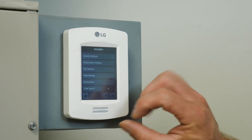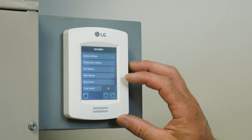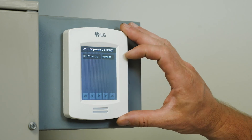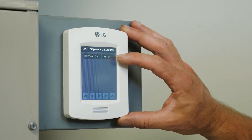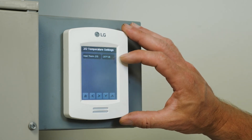I'm going to go back and now I'm going to set up and go to search code 15. Search code 15 is the heat offset, which defaults to about 7 degrees. So we get complaints when this isn't set up correctly — the room temperature is overshooting about 7 degrees. So that is 15. We have default. Tap on that to highlight it. And now I'm going to go to plus or minus 2 degrees, which is 1503 in the service manual — you can see right there, parentheses 3.